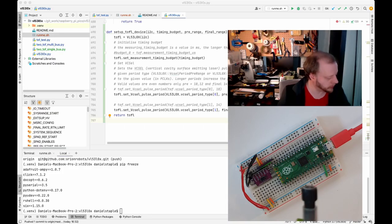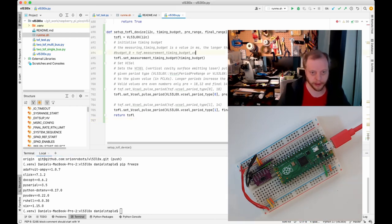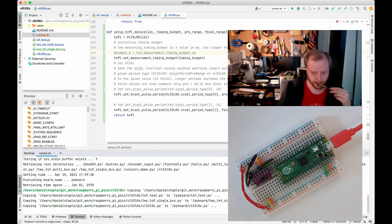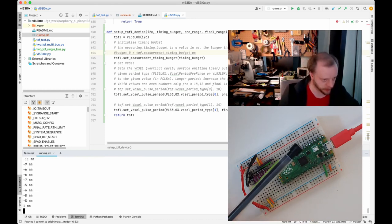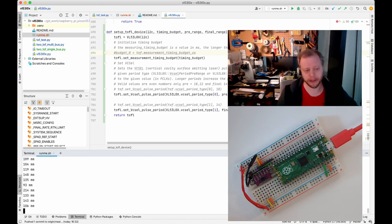That's wired in. Over to the code — when I wave the pencil over the sensor we should see data coming through in the output. I've got it tied to a run configuration in PyCharm, so hitting play uploads the files and starts running. It's probably detecting the camera as a few hundred millimeters away. Wave the pen and you can see it respond. That minus 50 offset makes some readings go slightly negative, so calibration's a bit iffy — but it's good enough for a robot avoiding walls. You just need to know which sensor is closer to a wall.